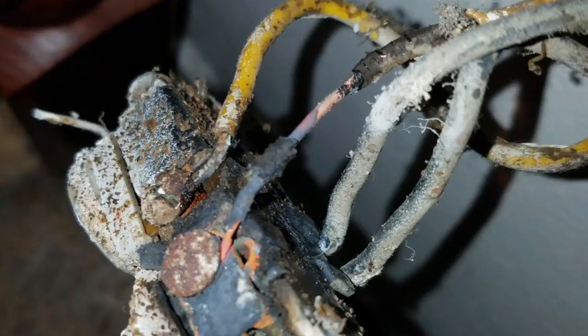So I go back in, look around, and made a few educated guesses — looked at a few of the devices and found what I think was the problem. I pulled out an outlet that looked burned, and it had actually cracked in half. Maybe they were kicking it or something. Inside there were wires that were shorted out and melting.